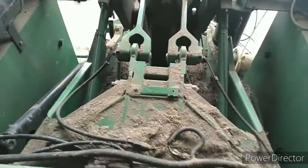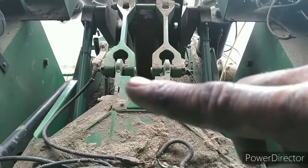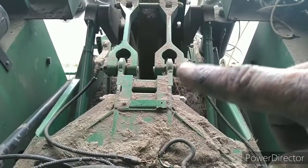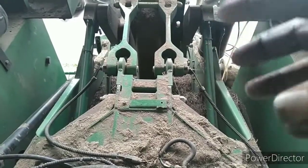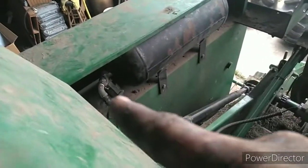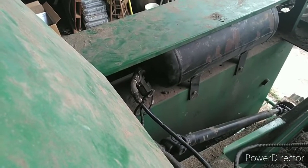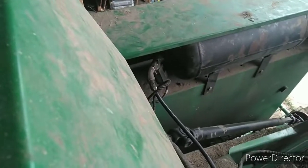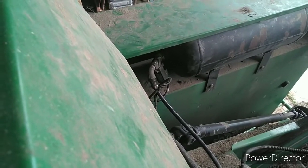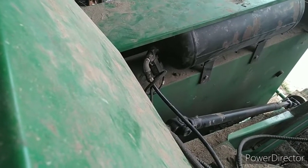Like we were talking, there might be an o-ring or something inside that control block that's bad. Or it could be the sensors on each side — they're weight sensors. They feel the pressure of the chamber and help calibrate your chamber pressures. We also took that air valve off there and took the old one off the other baler. The original one leaked, so we took them both apart and cleaned them both up. Now we got that working.